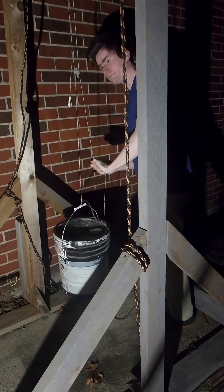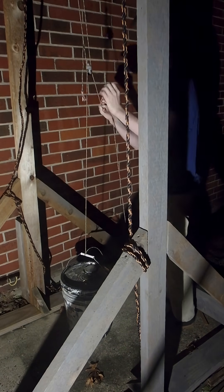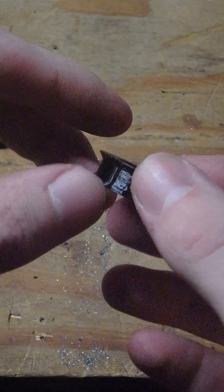That's not really what's important. What's important is the shape of the wheel. I was using a depth on my wheel of about half the thickness of the rope, and that was just pushing it to the side. So I doubled that — went for 4mm instead of 2mm — and now it's working great.